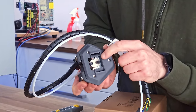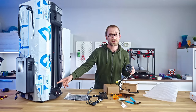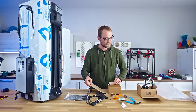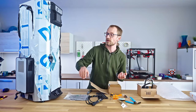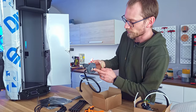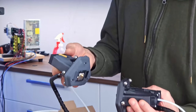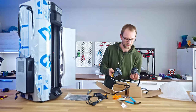These tool heads go to 350 degrees Celsius out of the box, however the heated bed only goes to 80. That is a bit of a weird combination, because all the high-temperature filaments like polycarbonate or the high-temperature nylons also need a high-temperature heated bed, so let's see if the fully enclosed build envelope helps with that. Then this is just the exact same thing — brass nozzle for PLA filament, both 0.4. That's an interesting choice to just include two full tool heads with a different nozzle, instead of giving you an extra nozzle to swap out. You just get two complete tool heads. This one also looks printed from what feels like ABS or ASA — I guess that indicates it's the lower spec version.